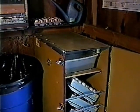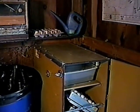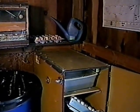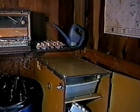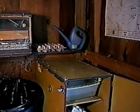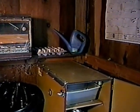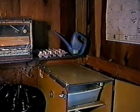and the humidity range is around 68%, give or take. If you want to decrease your humidity, you can put a piece of cardboard or a piece of plywood paneling over the surface, just an inch or 2 inches or whatever you want to do. If you want to increase your humidity, they have some pads now for sale where you can actually put it in the pan, and it gives you more surface of moisture.